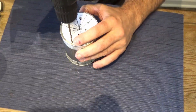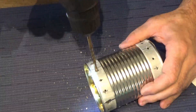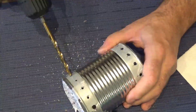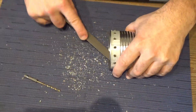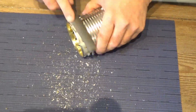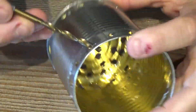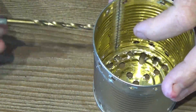Here you can see that on each hole I'm putting in a pilot hole — a smaller diameter hole to make drilling easier — and then going around the outside. I'm drilling three-sixteenths holes around the top, then switching to quarter-inch bits for the outside of the bottom. Then I'm drilling the remaining 29 holes in the bottom and taking a file to remove any burrs or hanging pieces of metal that can interrupt the airflow. That's very important both for safety and for uninterrupted airflow.